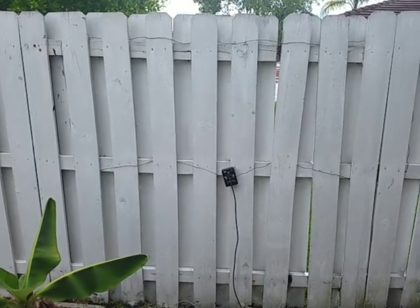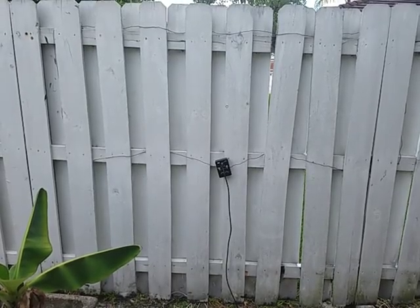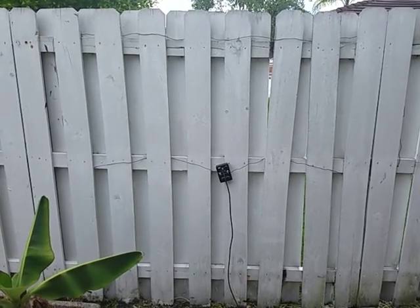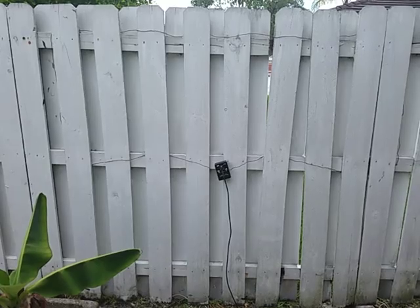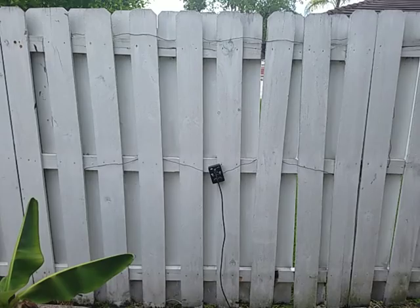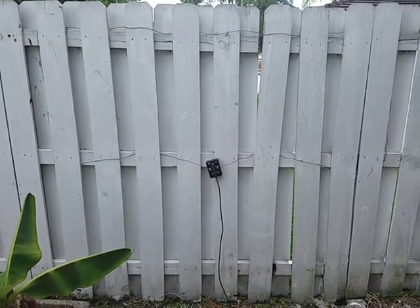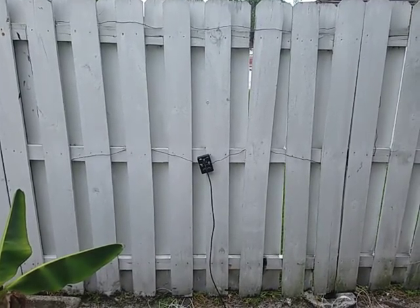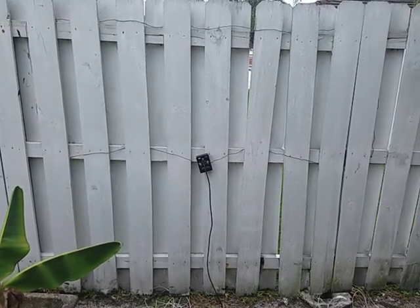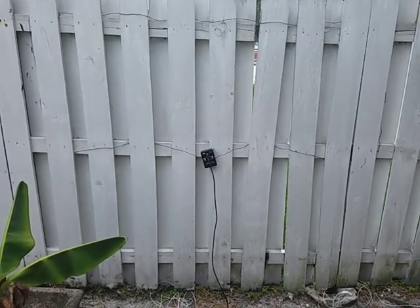Hello, this is November Oscar 2 Charlie Whiskey. In this video I will try to make a comparison between the MFJ-9232 portable loop tuner and see how well it stacks against a dipole. I have a dipole which is cut and tuned for 20 meters, and it is not as high as it would be, so it's a little less than optimal position, but it is well tuned and represents a somewhat realistic average 20-meter dipole that you would find out in the field.